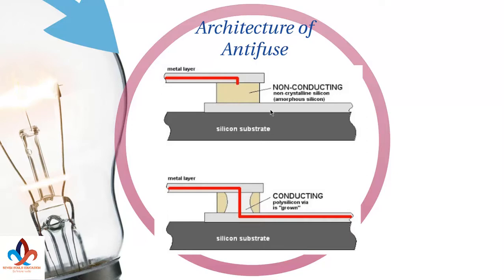Current cannot flow through it. This red line represents current flowing — it's not flowing through this. But if the voltage level exceeds a certain minimum value, the current starts conducting. You can see in this figure the current starts conducting, and a link has been generated in between this sandwich layer.